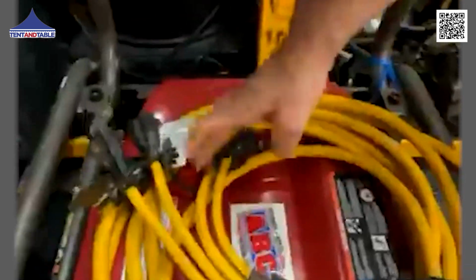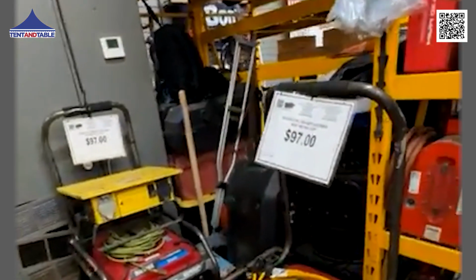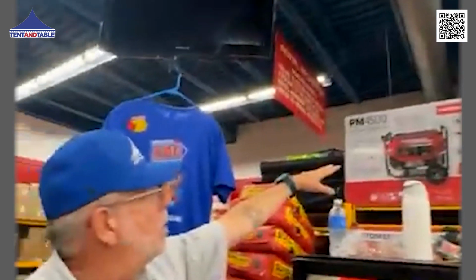because it's 7,500 running watts, even though I've got 1, 2, 3, 4, 5, 6, 7, 8 physical plugs to plug into, I'm only at 7,500 running watts. At 1,500 watts to 2,000 watts per blower, I'm going to get, you know, 3 blowers off of that.